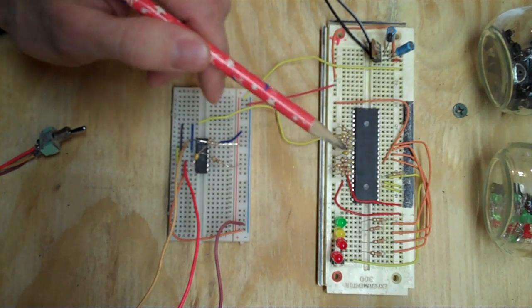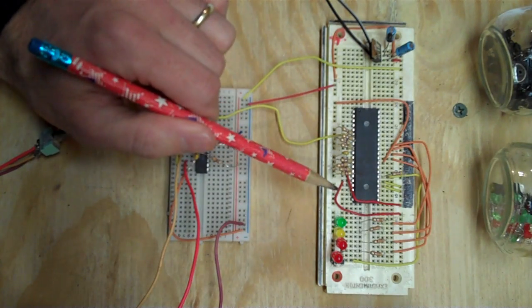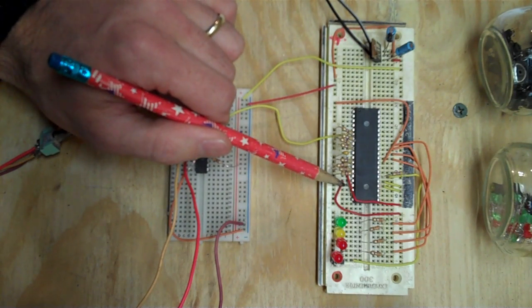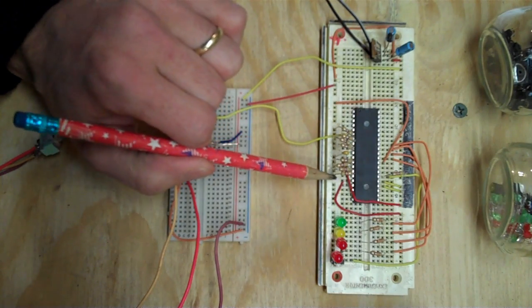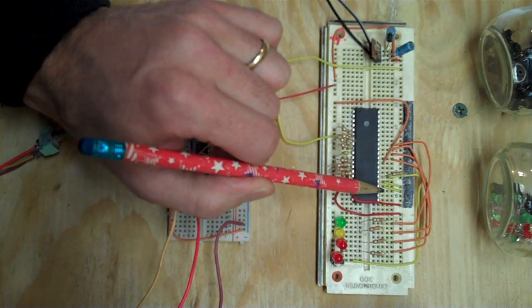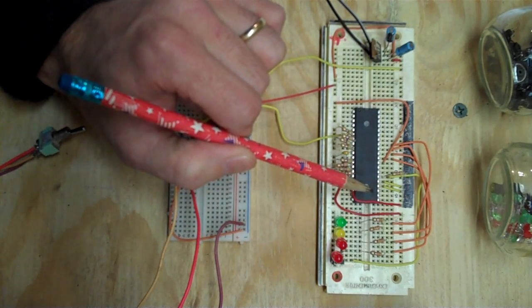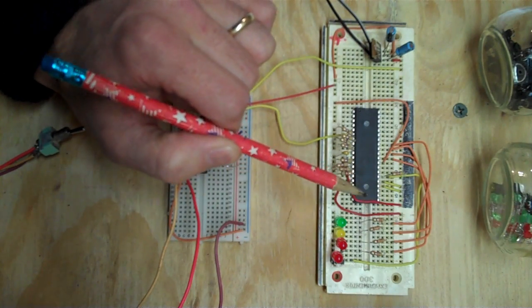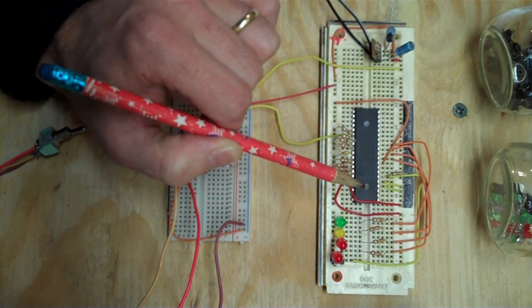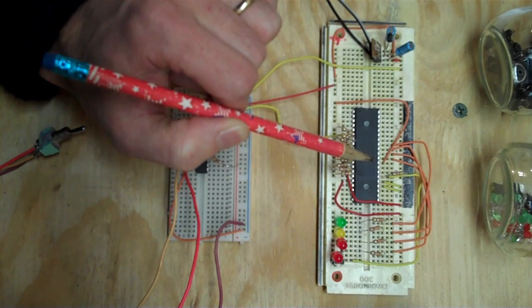We have a couple signals tied. First of all, we have, what are these? This is interrupt and NMI, non-maskable interrupt. There's actually 2 lines here, although there's only 1 wire going in because I've joined them with a jumper here. On this side, these 2 yellow ones here, there is wait and bus request. Wait puts the processor into a holding state, and then bus request is used for DMA transfers. If you assert bus request, it actually turns the processor off. So obviously we want that tied in a low state, or an off state rather, so that we know the processor is not going to hang on something.